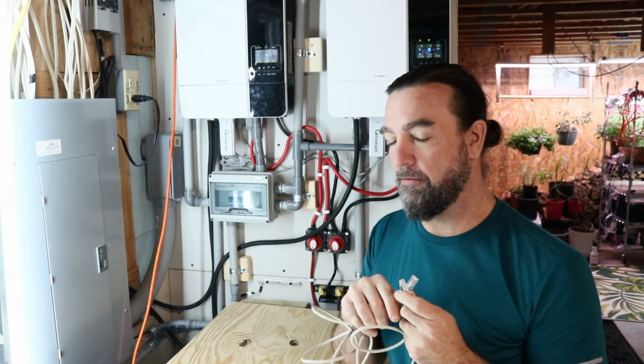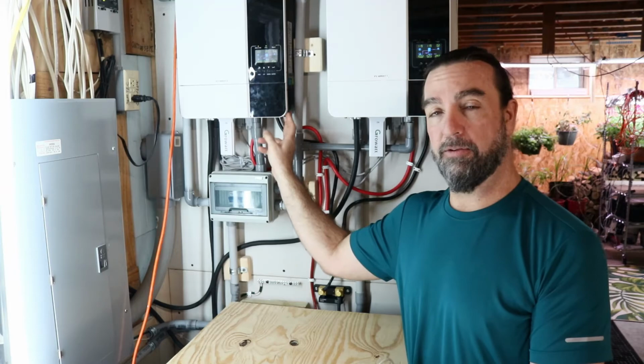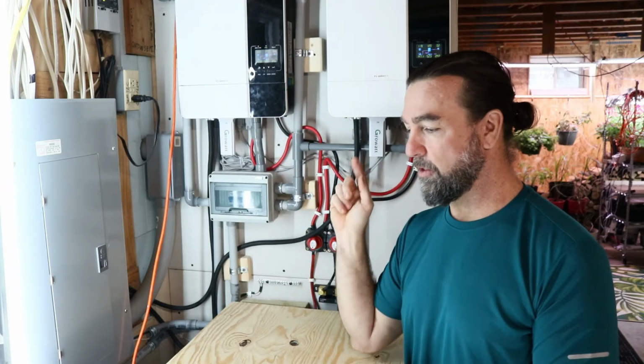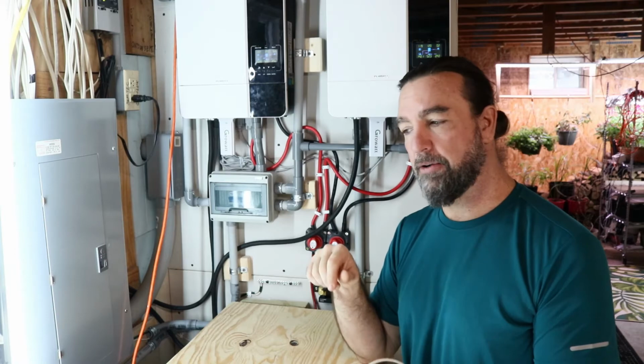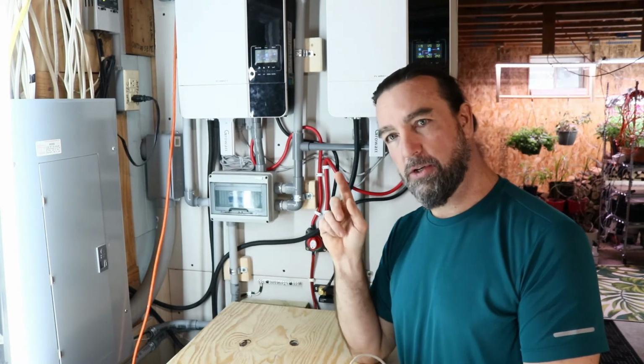You can see in the video where I'm not speaking. I connected them. I configured this inverter in single phase, and disconnected the communications between the two with the DB connectors. It was running only a single phase connection to the batteries, eliminating all other possibilities. It was a direct connection. I still got the error codes 4 and 20.